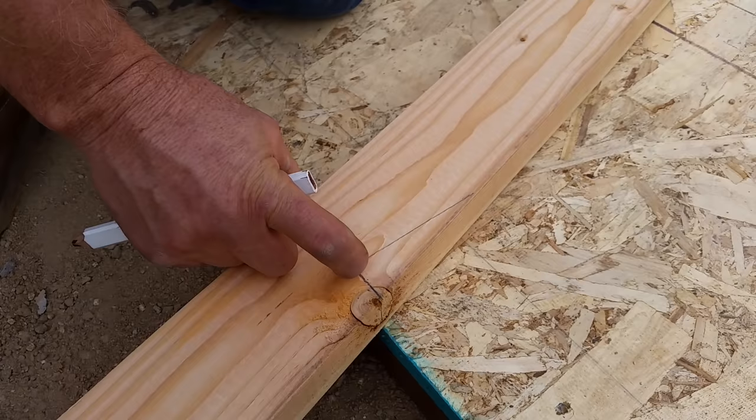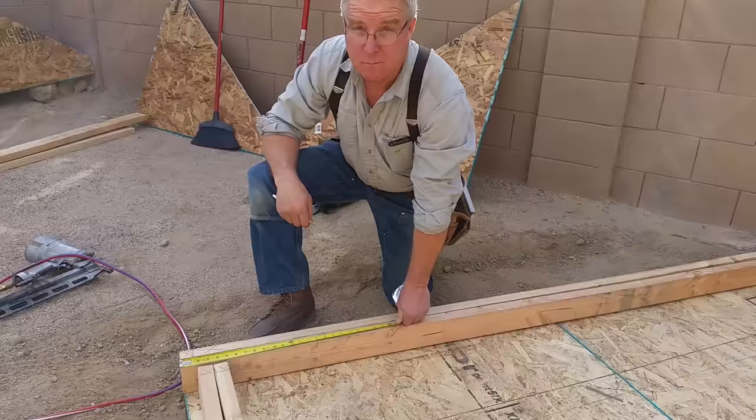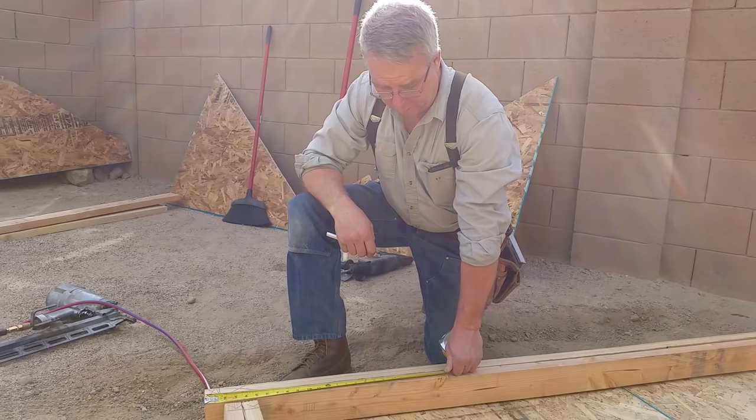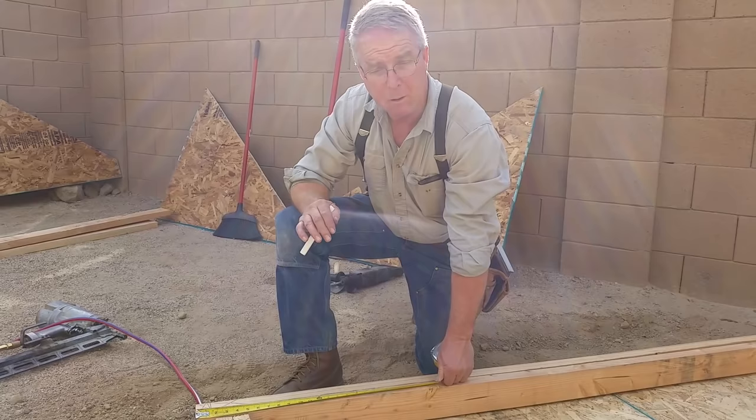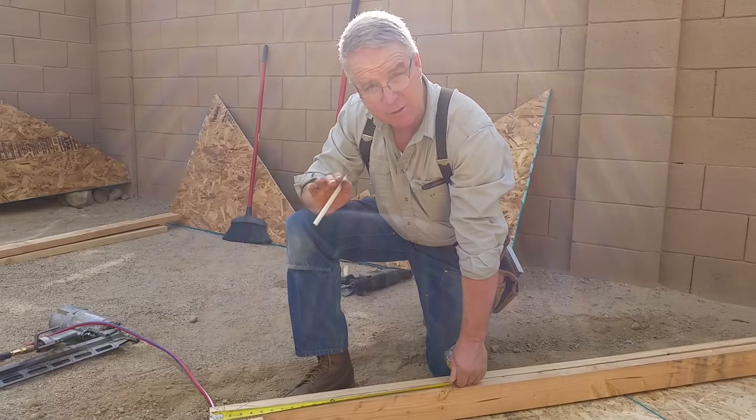This is not a very strong piece of wood, but that's not a very long overhang — it'll work fine. We're putting the studs on 16-inch centers, which is serious overkill for a little building this size. But we're putting T111 plywood-type siding on, and if you put plywood siding on 2-foot centers, there's a tendency for buckling to happen in between. 16-inch centers holds it flat.